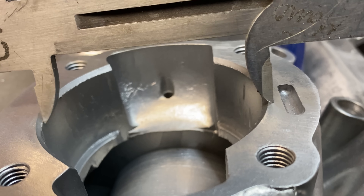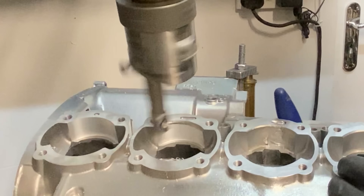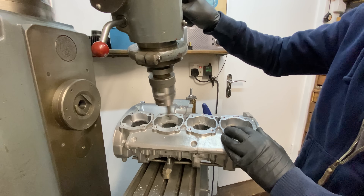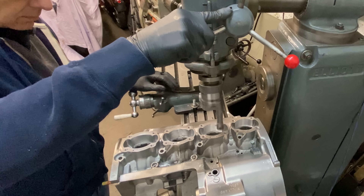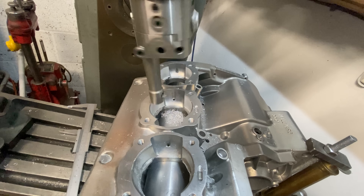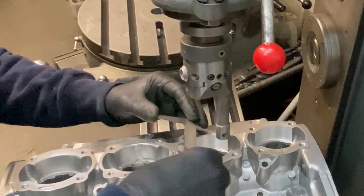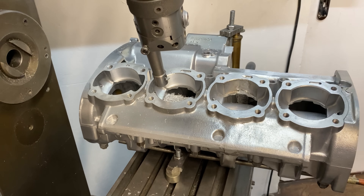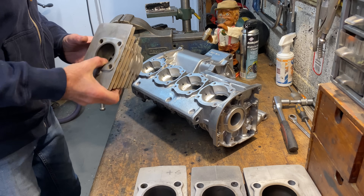As you can see here, it's not much to come out — maybe about a millimetre and a half. I'm using an adjustable boring head in the milling machine, which allows the cut to be increased gradually until the correct diameter is reached. I feed the cut down by hand, take a few cuts, then check with my vernier caliper and the size is just right. I check the barrel on the crankcases and it fits perfect — I'm really pleased with that. With the machining complete I remove the crankcases, put them back on the bench, and try all four barrels and they look just great.